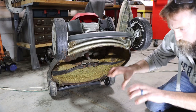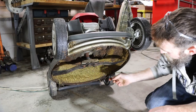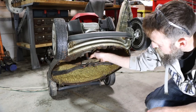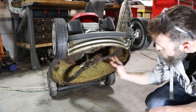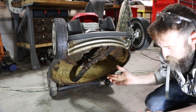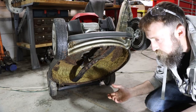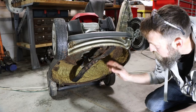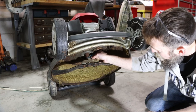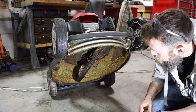So we got the spark plug out, we got the engine brake handle pulled with a zip tie, and we should be able to spin this thing by hand to see if the crankshaft runs true or, you know, runs eccentric. So. Oh man, it is bent. That's why you check them. You never know. Chances are the reason this guy stopped mowing with this is because it vibrated. He may not have known why it vibrated so bad, but chances are it's because of a rock or a tarp, actually. They will stop one so quick it can bend them. So that's what's wrong with it.